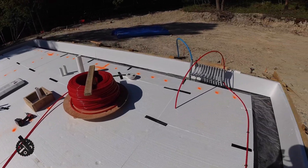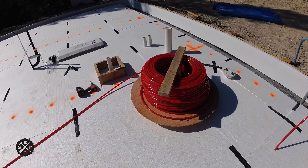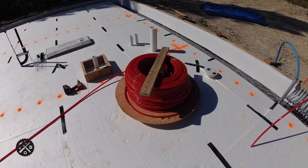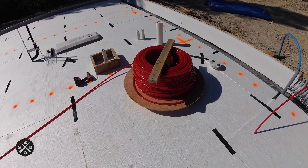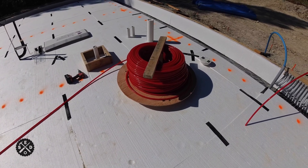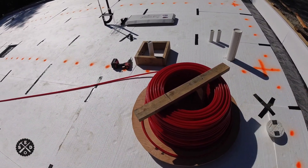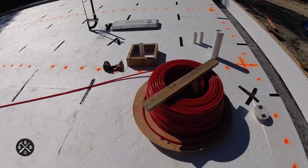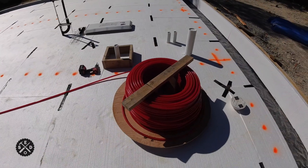I'm getting ready to start my radiant heat PEX tubing in the floor. I wanted to show you this PEX tubing uncoiler that I made — I actually have a video on this already and I'll include a link below and up top. This is a revised, simplified version. I put 2x4s in like this, screwed them from the bottom up, and I'm using 2,000-foot rolls. I just pop two screws on top, put the new roll on, put those screws back in and it works great.